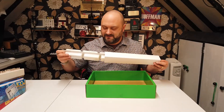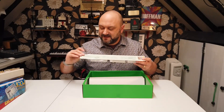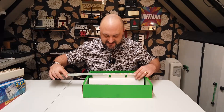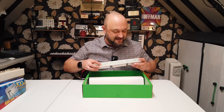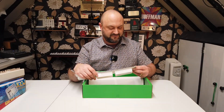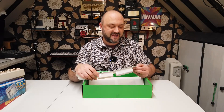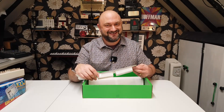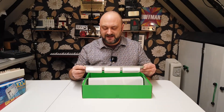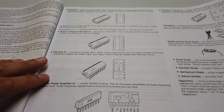In here we have components in almost blister packs — one's got resistors and stuff like that, and the other's got a crystal earpiece, variable resistors, wires, capacitors, and ICs. The ICs include a quad two-input NAND gate, quad two-input NOR gate, presettable up/down counter, binary-coded decimal to seven-segment decoder, JK flip-flops, a quad op-amp, a couple of transistors, some diodes, and loads of resistors.